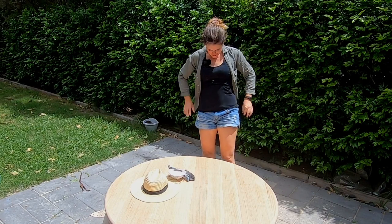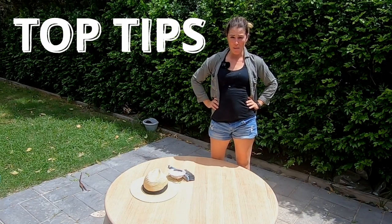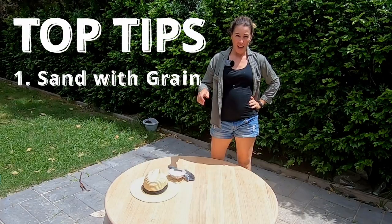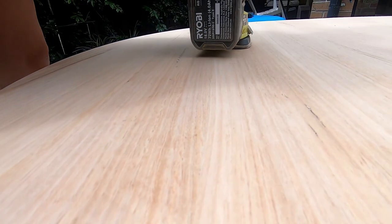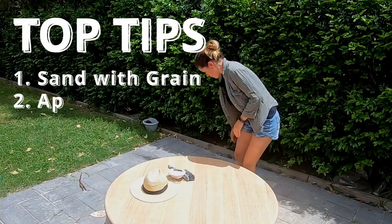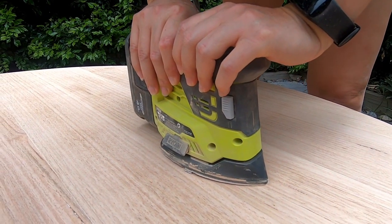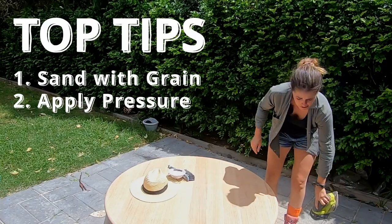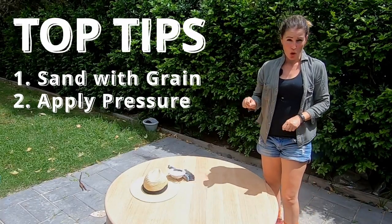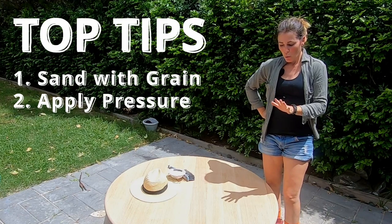Now that the top is finished, here are some tips for doing furniture like this. The first tip: when you are sanding, no matter what type of sander you use, go with the grain of the timber. That way you avoid scratching and tearing and the end product looks a lot nicer. Second, make sure you apply pressure - when I was using my sander you would have noticed I was pushing down with both hands. Applying pressure really helps with hardwood like this. If you are refurbishing softer wood or laminate, don't apply pressure because that gouges into the wood.